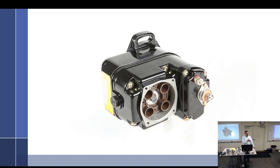They're different. You time them at top dead center, and then you put it in at top dead center, and then you tell it where you have dip switches, and you tell it where it's supposed to fire at advance, and whether or not you're using the spark advance. So I was going to get one for my airplane, and I thought I'll just not spark advance it and run them both at whatever, I forget what mine is, 28 or something on my airplane. Just run them right there, and that way I would have one magneto that gets changed out every 500 hours, and then the electronic ignition is good till overhaul of the engine. But I read a lot of stories, people saying, I don't like it, I'm on my third or fourth one, it keeps failing. I'm like, well, I don't want that. So still a little unsure about that.